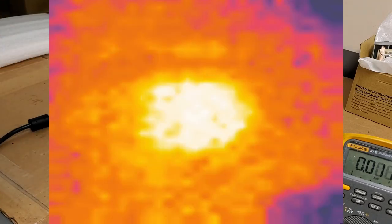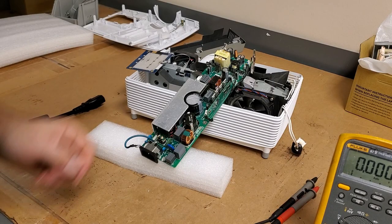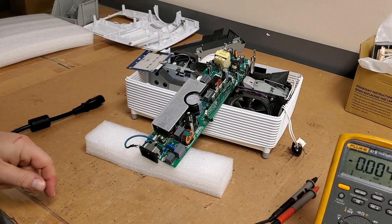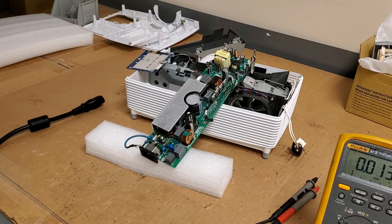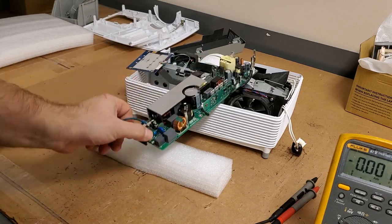And there's a little bit of offset, you know, parallax. But when I held my finger in the video, it lined up. So I'm wondering if this is bad. If there's maybe a leak inside, the coils might be leaking. But something's definitely dropping the current. Capacitor, maybe. Leaky capacitor, high voltage cap, maybe. Frustrating, though, when you're unable to really get in there.